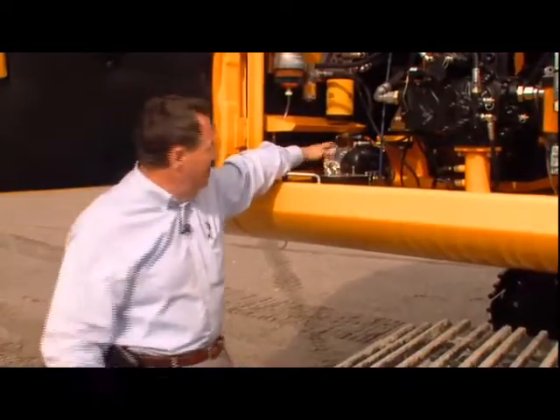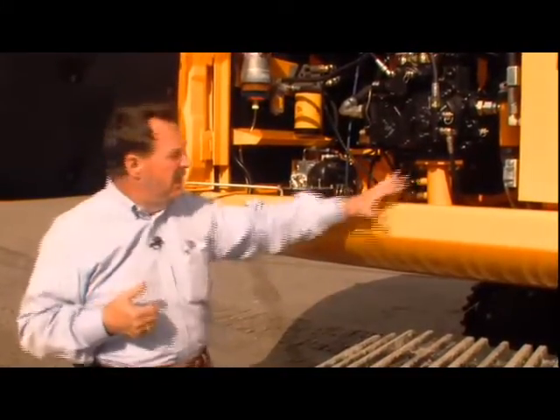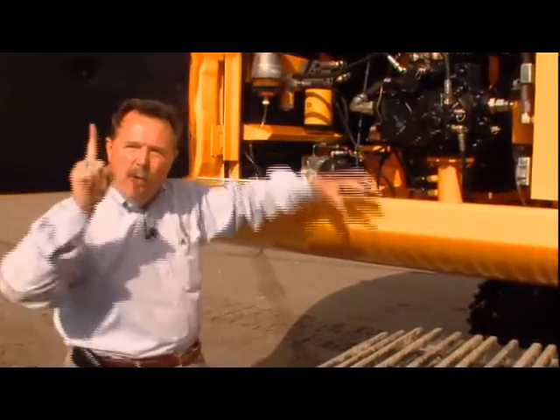So that means this filter will even separate moisture out of the system. At the end of the shift, that oil is cleaner than when it started out — and that's the key in high-pressure hydraulics: keeping that oil clean. That's the life of the pump, to prevent contamination. This feature equates to real savings, because it means you only have to change the hydraulic oil in this machine every 5,000 hours. This machine may only be out to a customer for 5,000 hours — he may never have to change the hydraulic oil as long as he owns it. 5,000 hours on hydraulic oil, 1,000 hours on filters.